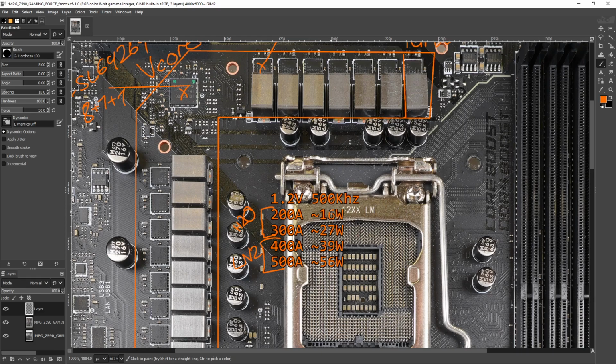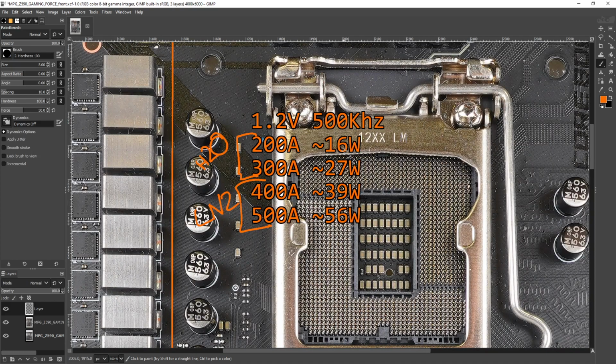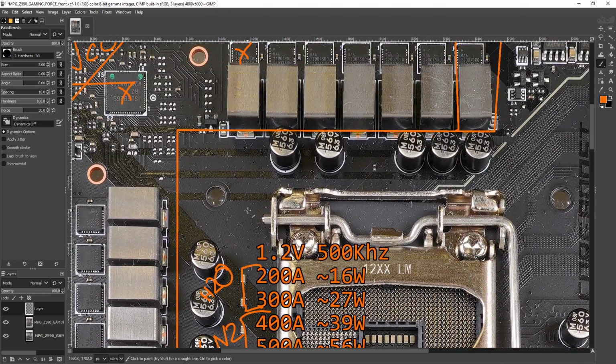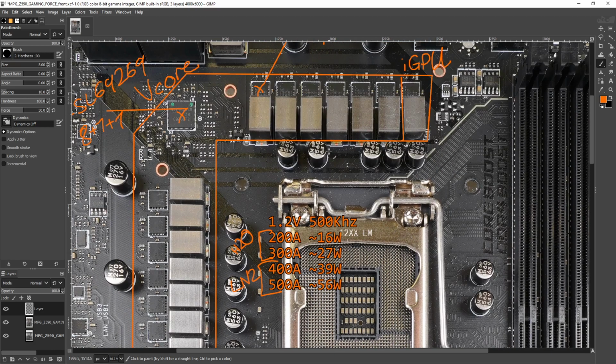So really, all around, a very, very solid motherboard. So that's what's going on with the power delivery. And then in terms of the output filtering, MSI is using a bunch of Nippon Chemicon aluminum polymer capacitors rated for 10,000 hours at 105 degrees.